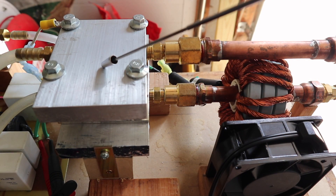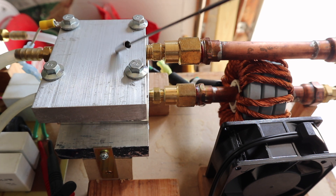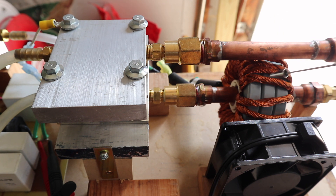The capacitor is a conduction cooled capacitor and again I'm using an aluminum block with water cooling, which is absolutely essential. Here is the impedance matching transformer with a litz type wire around it to handle the current, which at the frequencies we're doing travels via the skin effect. I also have a fan to blow cool air since this gets very hot.